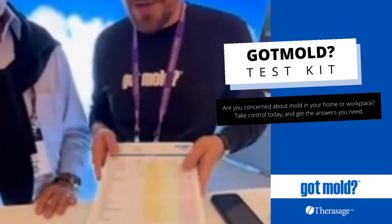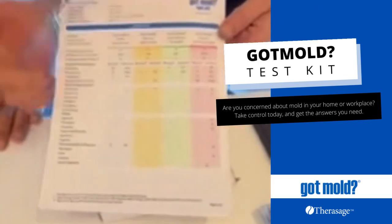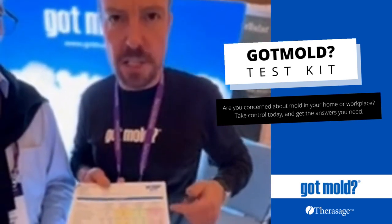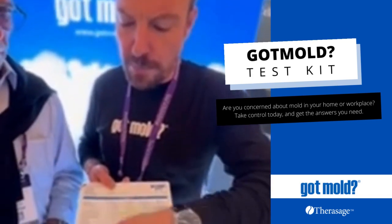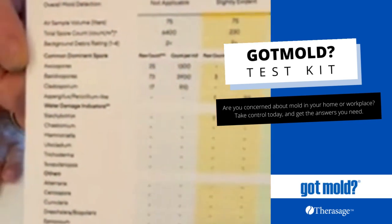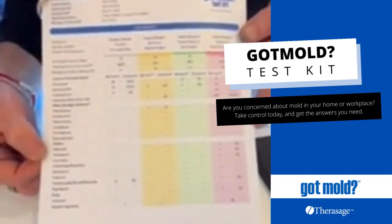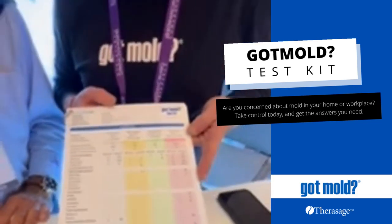There's also the raw lab data, which includes the types of molds detected and the quantities, as well as background debris, which is a general indoor air quality assessment. In other words, this is the microscopic dust load. You'll notice that we categorize these molds into common dominant spores, which is what it sounds like. These are the typical mold spores that are abundant in a normal environment, and then water damage indicators. When these show up even in small amounts, it's clear evidence that there's something amiss.